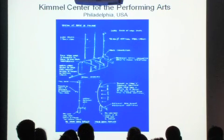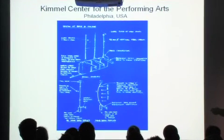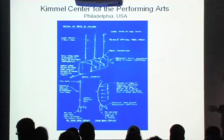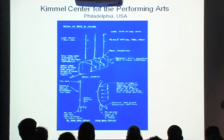150, right? So it's 150. If you didn't have any idea about really what happens with glass, you would look at the book and say, maybe we'll let it deflect 150 millimeters. This is actually deflecting 1 meter under full wind, right? And the reason is that each piece of glass in that big grid, although it's moving 1 meter, in itself it's only bending a little bit. In fact, not very much at all.